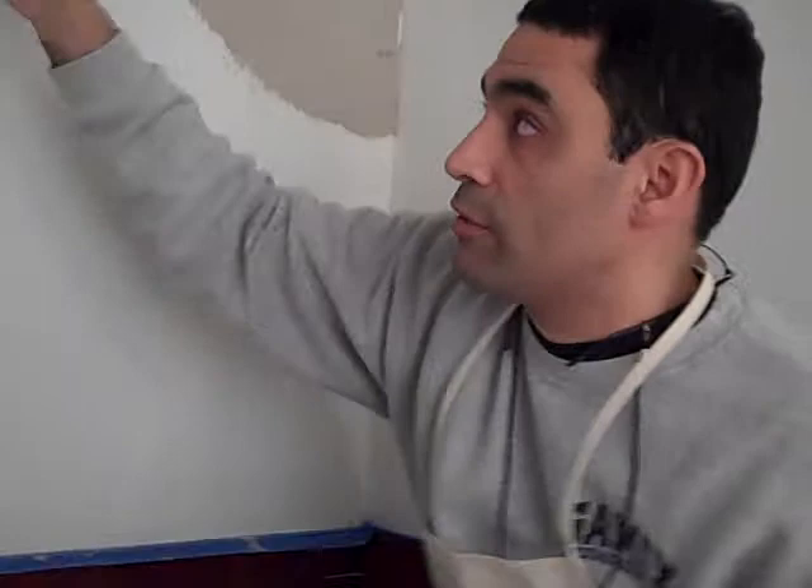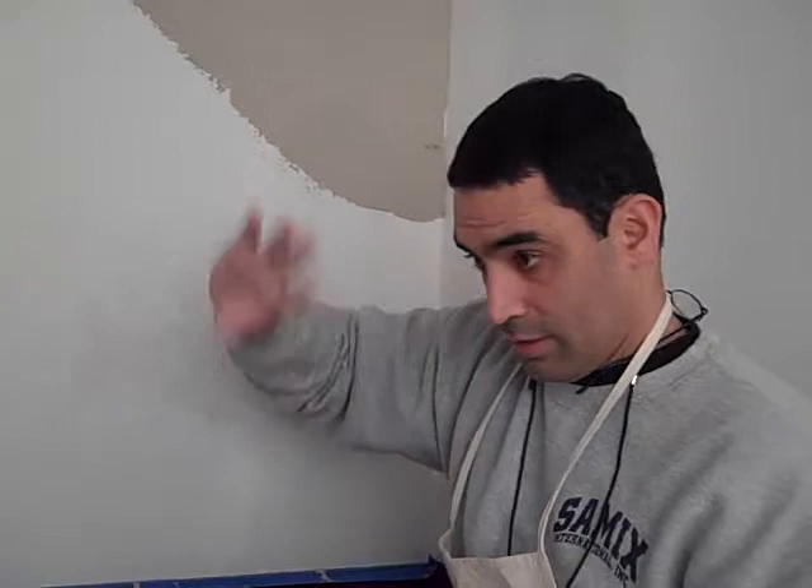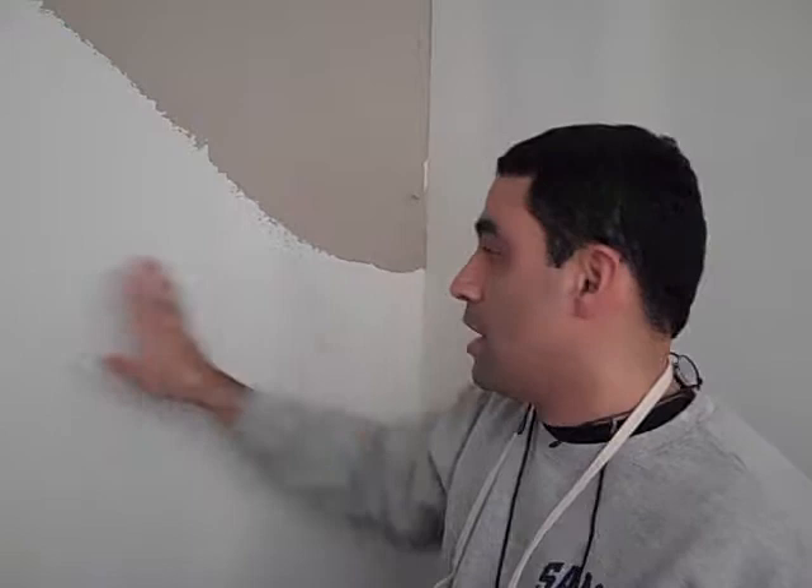You don't have to do this because I use the Prime Plus, but I like to take precaution and do both so I don't have to come back and worry about it peeling. This primer went over sheetrock that was new with plaster, so the absorption of the clay — the plaster from the clay — is not as much in areas. If I didn't prime it, it would absorb more in these corners where the plaster is than here on top. So this gives it an even finish.